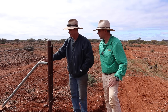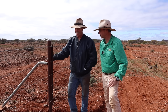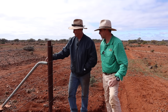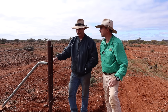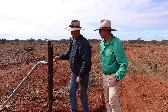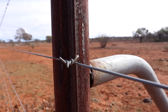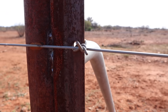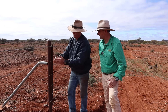What we've also got is a 1.2-metre double-bend angle stay. The bit into the ground is about 600mm from the bend, with a short bend at the top. They're prefabricated — we buy them off the shelf. That's giving this post support with the weight of the wire and the weight of the water all pushing that way. We've also got a star picket welded on — just any old black star picket, probably a second-hand one. We've cut the bottom off. It's there just for wire separation, to hold your wires from sliding up and down around this post.